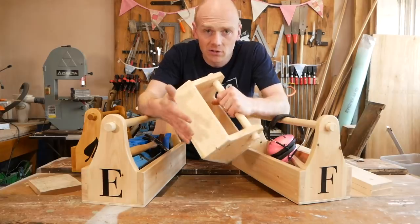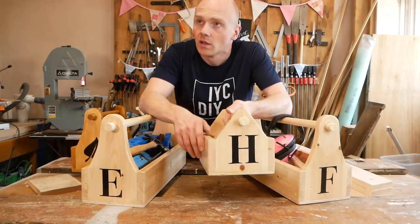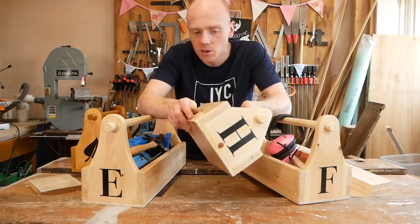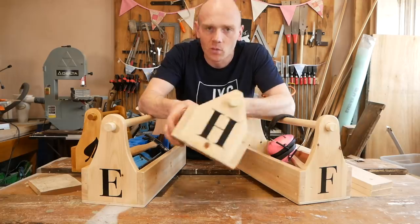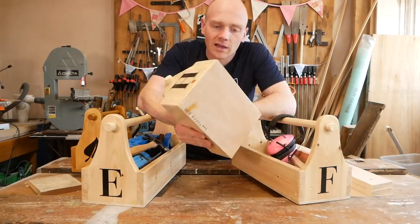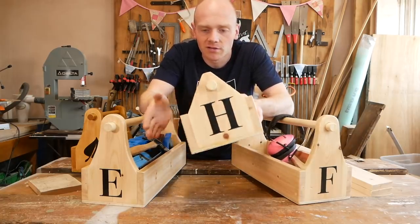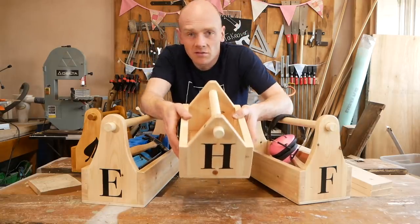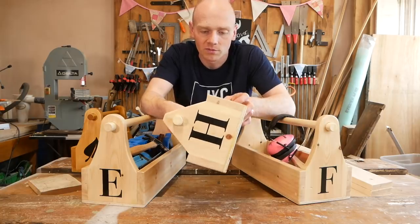The finish we used was a water-based varnish for interior use. I don't really use varnishes — I usually stick to hard wax oils, waxes, or oils — but actually it's super quick drying. You'd have to work on it a little bit to get a really good finish, but you could almost wipe it on. Really impressed, and for simple indoor projects it's a good way to go. The one we used was Rustin's, which is a fairly simple off-the-shelf option available from Tool Station.